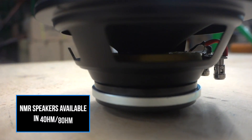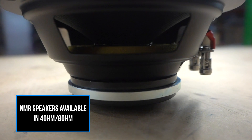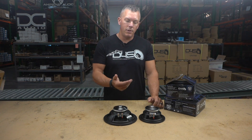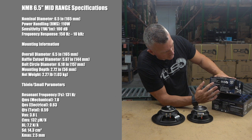The eights come in four ohm and eight ohm — they're 120 watts RMS. Same thing with the six and a half: 110 watts RMS, and they also have four ohm and eight ohm options. So let's look at the frequency response for the six and a half first.